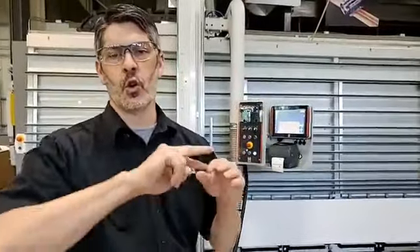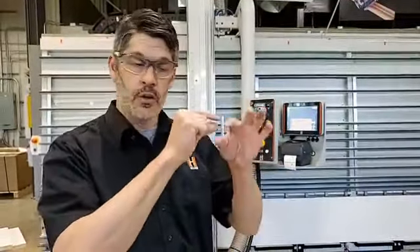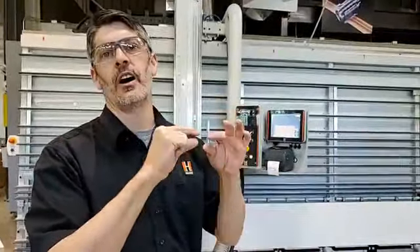How do you make such clean cuts? Ahead of the blade there's a scoring device — two knives that go and scratch or break through the melamine coating just on either side of where the cut line will be. Therefore, when the blade comes around, it's a nice clean crisp cut. No chips.